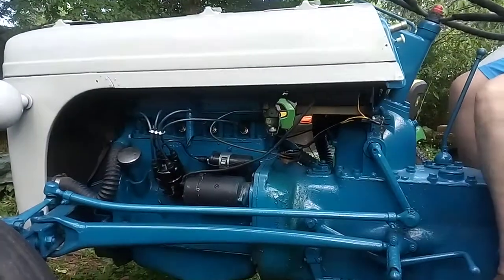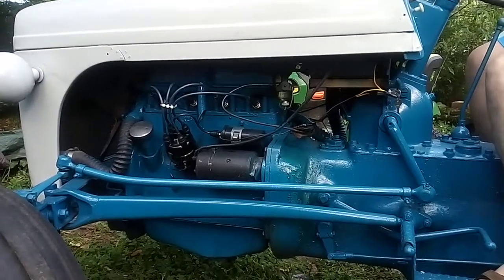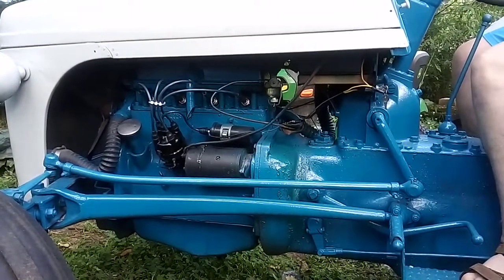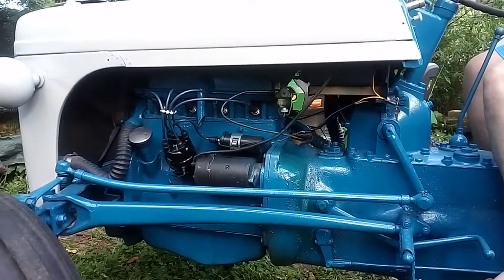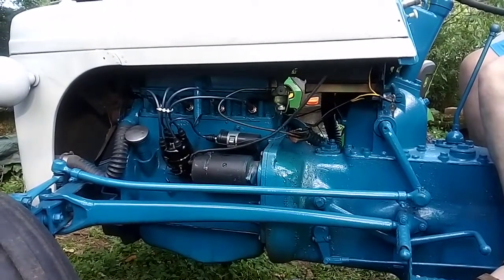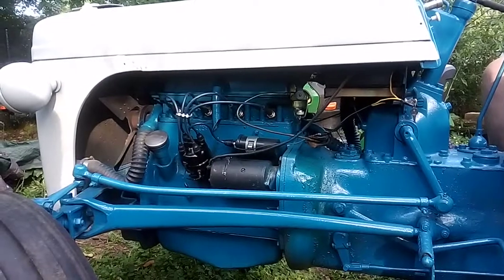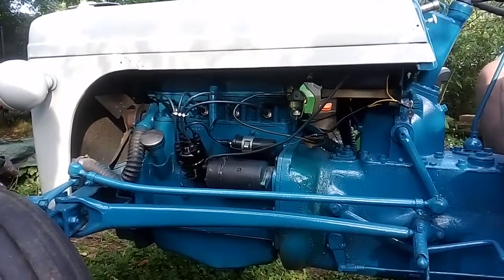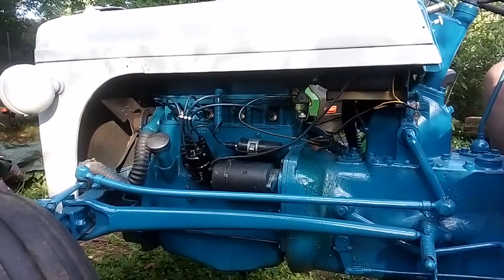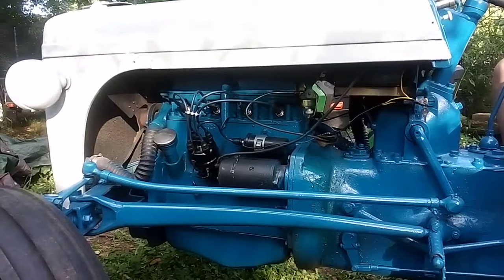Well hello everybody. We've been working on a 1948 Ferguson TE20 tractor. We bought this thing just a little while back — it ran when we got it but didn't run right. We started out from scratch with it. The plug wires were messed up, one totally broke off stuck down in the distributor cap. You got to watch things when you buy tractors. When we bought this, someone had put a Ford distributor in it — it's supposed to have either a Delco Remy or a Lucas.